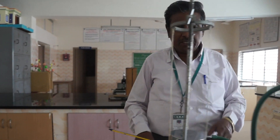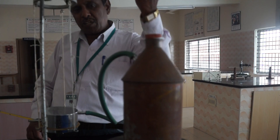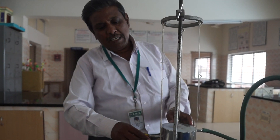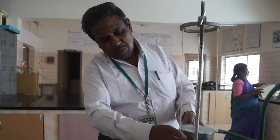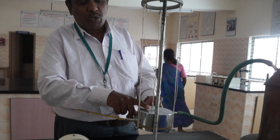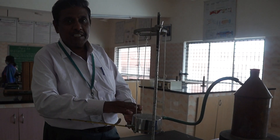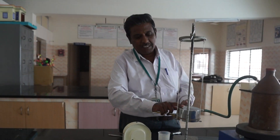Now, how to do the experiment. Initially we are heating the hot plate, and the temperature of the steam chamber goes up to the boiling point of water. The steam comes through the upper chamber. You can insert a thermometer in the hole provided here and note down the temperature when it reaches a maximum. This is called the steady state temperature of the upper disc, theta one.